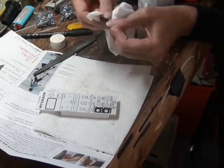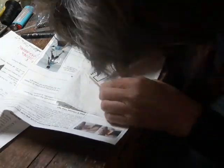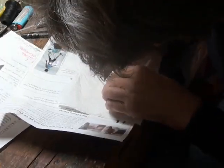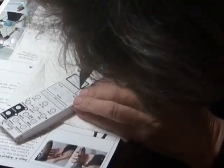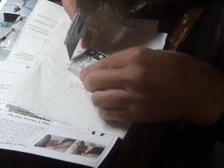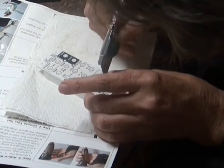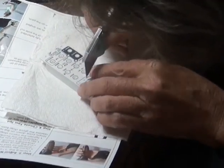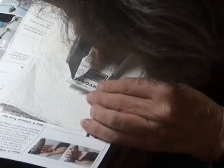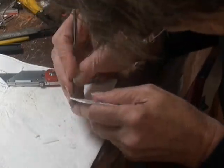I have to use a sharp new blade, so it's important to remove any protection oil from the blade. All holes should be poked through with a knife first, then carefully filed. It's important to cut the holes in a way that the pressure won't tear the paper away from the panel. Holes that will have edges covered by nuts can be coarsely filed, but exposed holes like for LEDs, buttons and the OLED window must be filed out carefully.